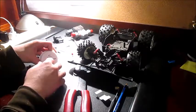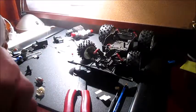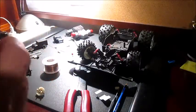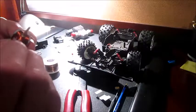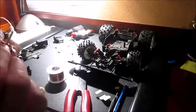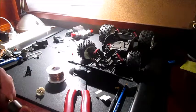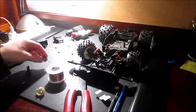Time to start rewiring this armature. For rewiring the motor, I went ahead and got myself 26-gauge wire. If you're curious about what the gauge is, it's simply the thickness of the copper wire. This is magnet wire, not your standard copper wire — it's called magnet wire because they put a little coating on here to isolate each copper wire from the wires around it and from the steel stator. If it wasn't coated, it would short out and most likely burn out the wires in the motor. By using pliers to lift the wire connections to the commutator and unwinding the wire from the stator packs, I took off all the coils from the stator.